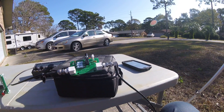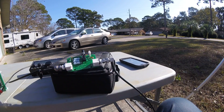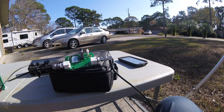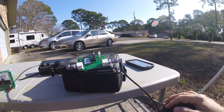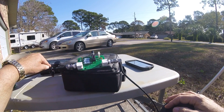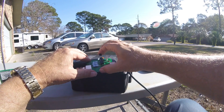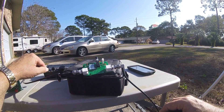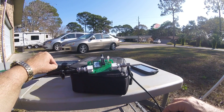The LED is kind of blue, but the game is to make it extinguish. There — it's extinguished. And by the way we're 1.1 to 1 on the KX2 SWR meter. Of course the real test is taking it out of the circuit and then putting the power to it. We're 1.3 to 1 — that's pretty close. Good enough.